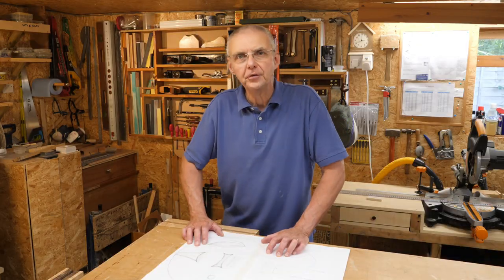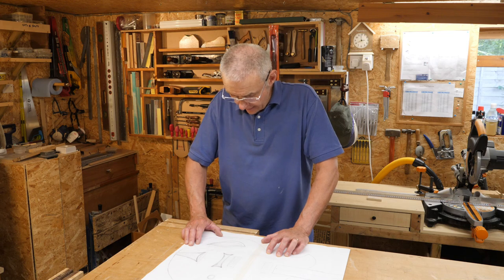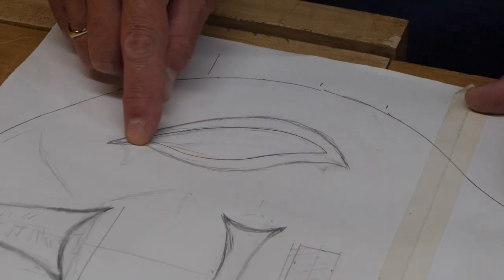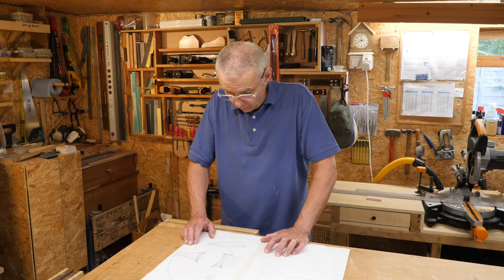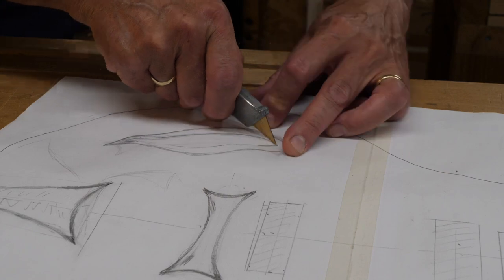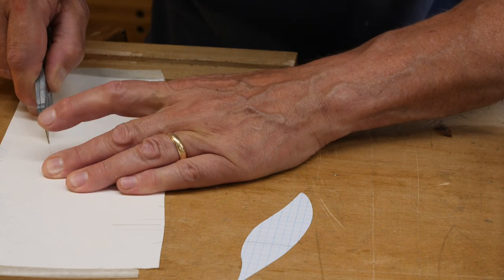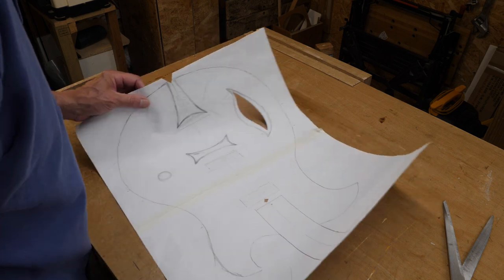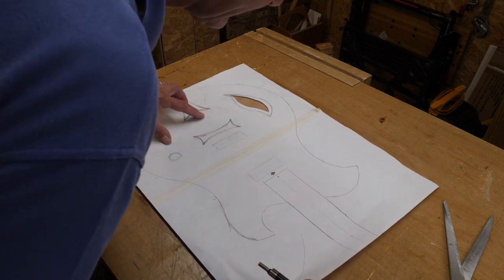It's another beautiful sunny afternoon and I'm back out in the workshop, and now I'm going to cut out the sound hole. To do that I've taken the design that Carolyn drew for me and I've just gone round it with some French curves to get a much better line. What I'm going to do is cut it out with a knife, and on the back I've stuck some cardboard so I can make myself a template. I've got a slot there and a slot there so I should be able to line the centre line up.